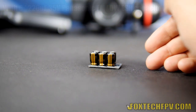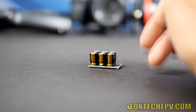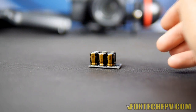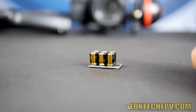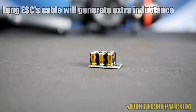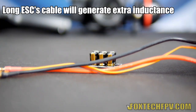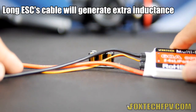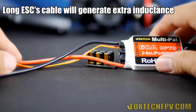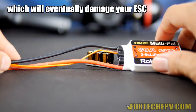Why are we making this kind of capacitor module? It's actually made for the long power wire ESC. For example, you are going to put your ESC under the motor or propeller for cooling, but the multi-copter has a really long arm, like 50 centimeters or 70 centimeters. In that case, you will need to add this capacitor module. This is because the two long power wires on the ESC will generate what we call an inductance effect on the capacitor modules, which will increase the temperature and eventually break down the capacitor and the ESC, making it not usable or causing a mid-air failure, which is very dangerous.